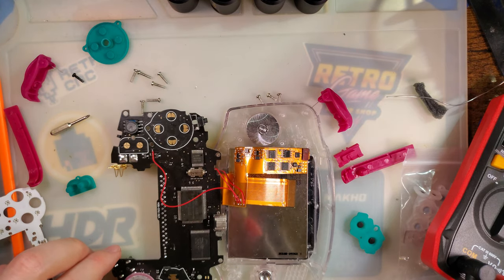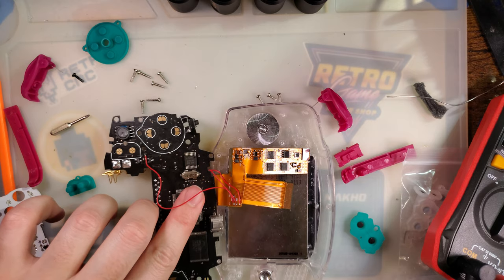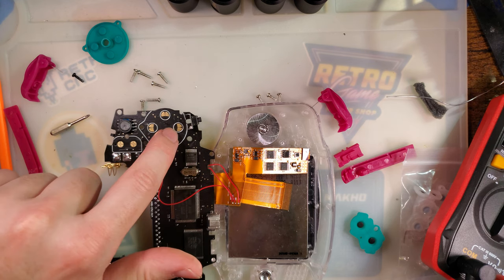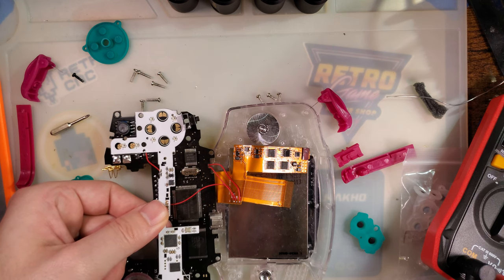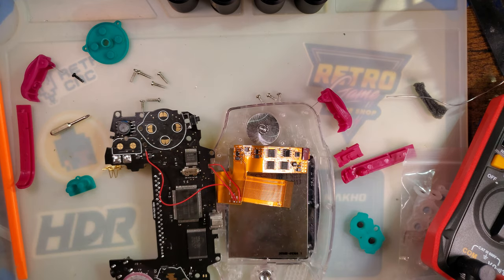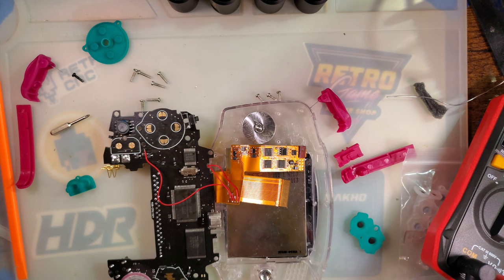Plan B was going to be somewhat ambitious — I was going to upgrade the motherboard that I hand-assembled. I did a stream a while back assembling a GBA from scratch where I assembled this motherboard. Unfortunately, the 'up' button does not have a test pad, so I can wire it to any other button, but that means one of these solder pads does not line up, making for a less clean install. In a clear shell, that's not the best match. This way I also don't have to downgrade my buttons — blessing in disguise maybe. I guess I'll find a GBA with a stock motherboard.